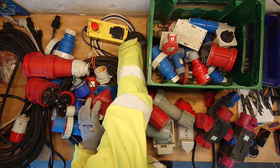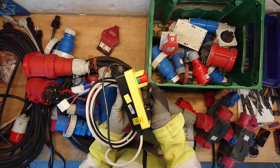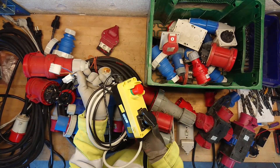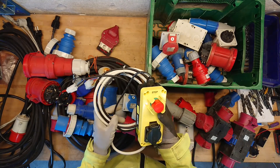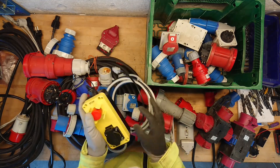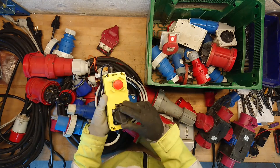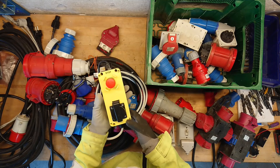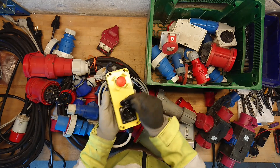The yellow one down here is a little special service plug from elevators. I heard from someone who installed elevators that this is something they plug in during the installation and calibration of the elevator, and you have to use it when you ride on top of the elevator car — so you always have an emergency stop at your fingertips when you're on the dangerous side. And you have 230 volt AC for your laptop or lighting, though I'm not quite sure what they use that for — I would guess it's for a laptop.